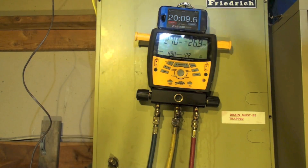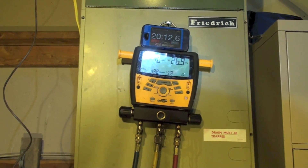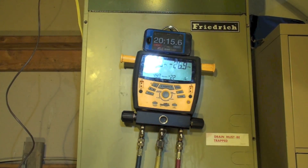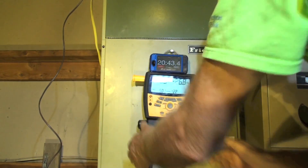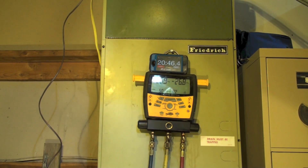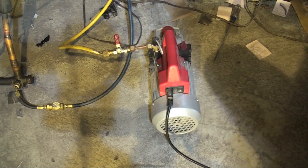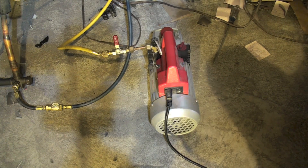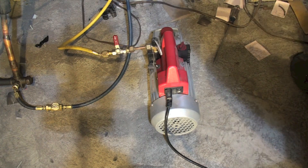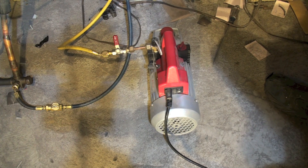About 20 minutes — that's plenty. I'm not going to get it any better than that, so I'm going to begin my second evacuation. I shut off both valves and the vacuum pump. Normally I would leave the vacuum pump on — I usually just shut off the valve. You may be wondering why I put this little valve in there. A lot of the pumps come with a built-in valve, but I've had so many of them leak that I bought a pump with no valve and put my own on.